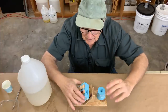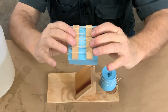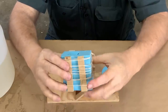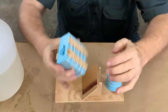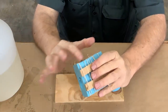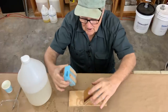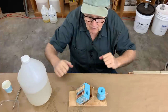I've got both molds ready to go. I've got this one set up nice and pretty, with lots of thin rubber bands for nice even pressure. These wood cleats transfer some of the pressure to the middle of the mold and take pressure off the corners so you don't get quite as much mold distortion. This little stand allows me to tip and hold it while I pour it at an angle.